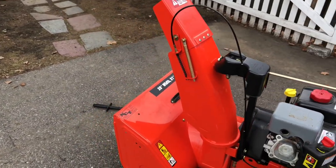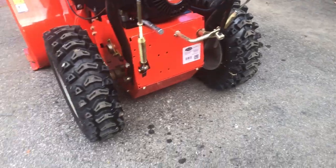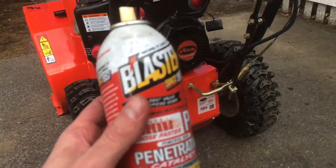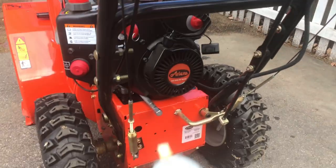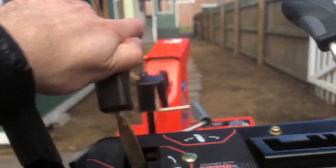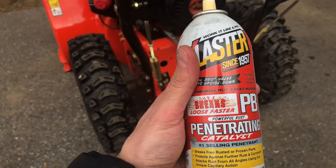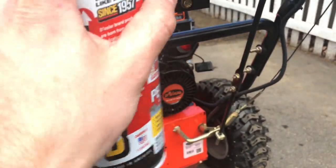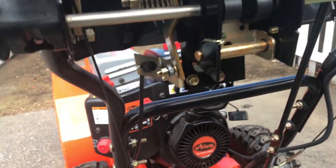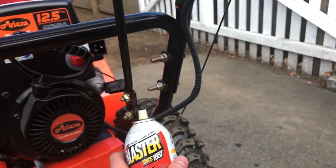Hopefully that's a nice top tip prior to winter for getting your snow thrower up and running. Another quick tip on keeping your machine running well for the winter: I'm using PB Blaster — you can use WD-40 — and I'm just looking at any moving part, metal on metal, under my snow thrower. I'm going to make sure everything's good for the winter, spraying any moving part, so anything that moves metal on metal — cables, things that move.